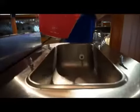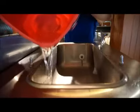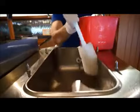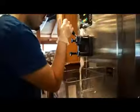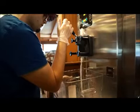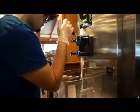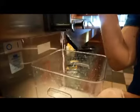After the machine has been fully drained of product and each draw valve has been purged, pour in 2 gallons of cool water into the mix hopper and brush the hopper sides, inlet hole, and level indicator to remove any remaining product. It is important to use cool water so that the milk fat in any remaining soft serve product stays in a semi-solid state to flush out easier and not stick to the machine parts. You will need to repeat this process until the discharge water is clear.